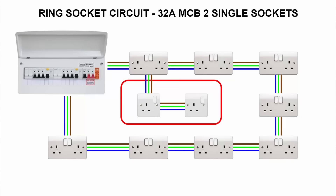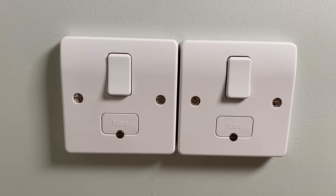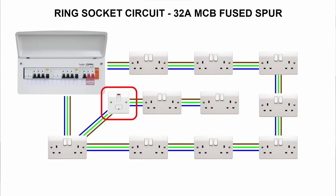You might think it would be okay to put two single sockets off a spur, but the regulations removed this allowance in the 1970s because there was a risk people would later convert those singles into doubles, giving two doubles on a single spur. If you do need to add multiple sockets to a spur, you could use a fused connection unit (FCU) or fused spur, which limits the current on the spur to 13 amps — then you can daisy-chain multiple sockets off it. You'd only be able to use low-power appliances, but most modern appliances are fairly low power so that's absolutely fine.